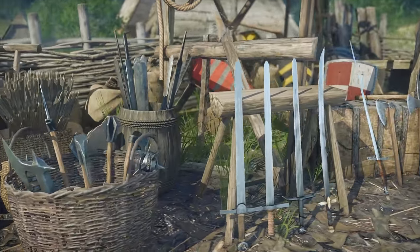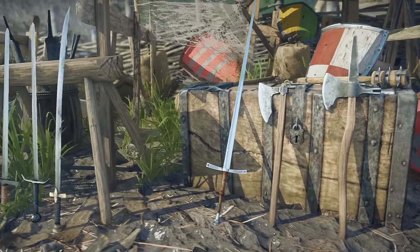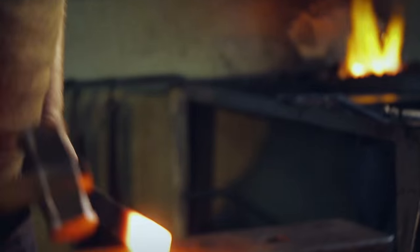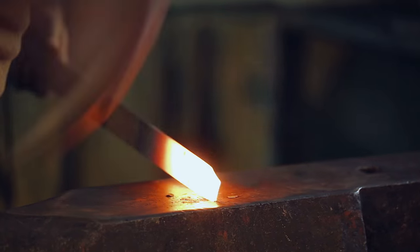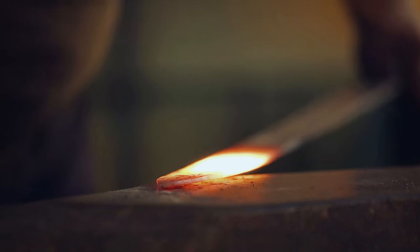We try to use ancient procedures according to tradition, according to how our ancestors made swords. Naturally, we use more modern technology to make production more effective, but still adhere to the ancient procedures. If we want to compare the quality of a machine sword with a forged one, we must take into account how the sword is made. With a forged sword, the blade is forged and the material is compacted — its crystalline structure is compacted and the sword is then much more resistant to wear. Unlike a machine sword, which basically does not go through the fire and hammer blows. Handcrafting is obviously more time consuming, but the sword would never look the same as when made by human hands, because the machine has no heart and can't shape the material the way a man can.